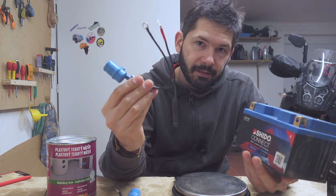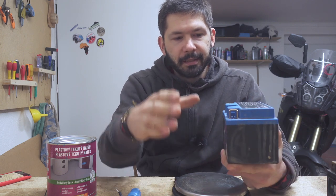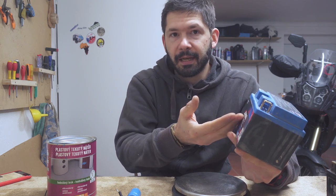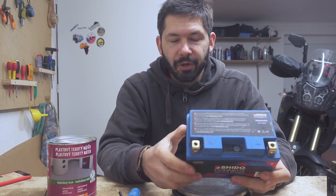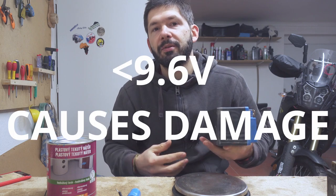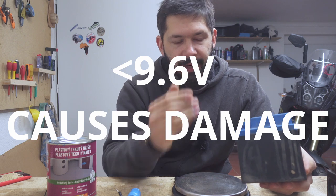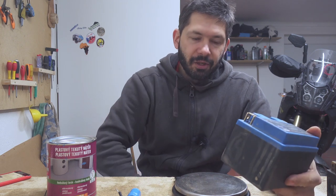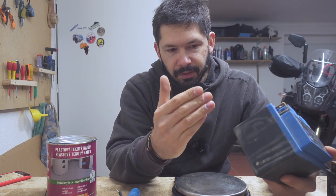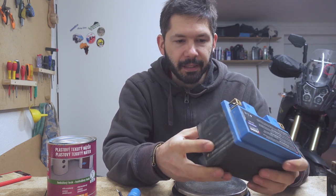Now for that reason you would have this. Nowadays these are quite good and it's hard to damage them — you cannot even damage them by overcharging because this battery has protection, so everything over 15 volts basically stops charging. It doesn't stop you from discharging it under the safe voltage though, so that's one way you can damage it. You can discharge it a lot and damage it. Another thing is if you short the terminals or physically crack it — that would be pretty disastrous.